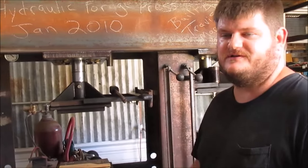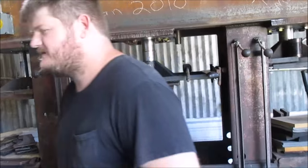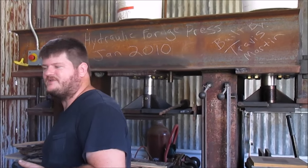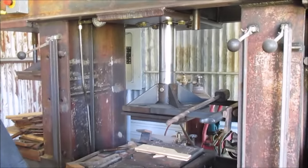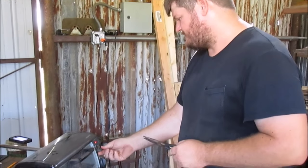I'm using my hydraulic press to squish the Kydex — there's a lot of room for it to travel, so I'm going to fire it up while I'm waiting for it to heat and bring it down closer so it's quicker to press at the end. I do have plans for other forms of Kydex press than using a 42-ton hydraulic press, but those are down the road. It's been a little over a minute, so I'm going to check and see how floppy the Kydex is. Nope, it's still too stiff, so we'll let it heat a little longer and maybe bump the temperature up a little bit.